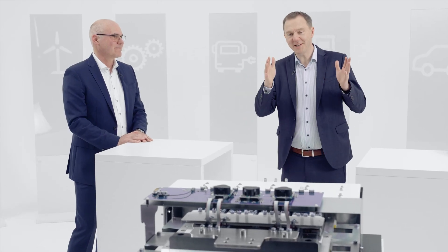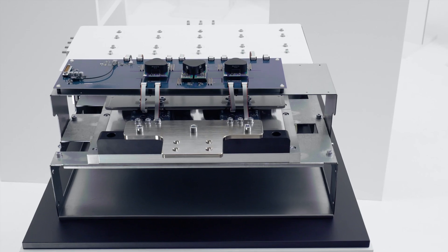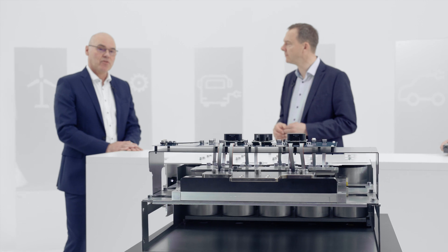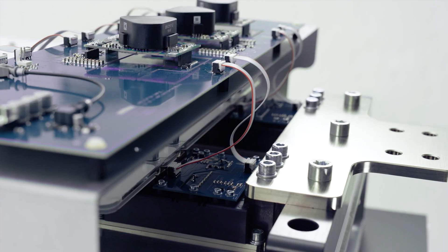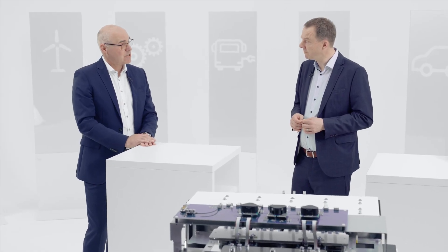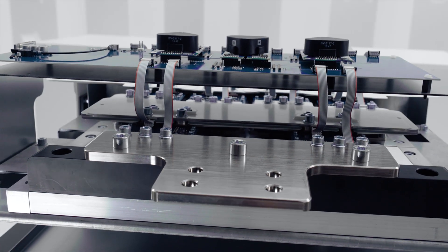I can't tell you how excited I am that you've brought a stack with you today — I'm sure this stack must be full of Semitrans 20s. Tell us about it. This is actually what we call an application sample. We have a fairly large application group supporting our customers, and we do these demo designs to promote our products and show how they are used in the field. This stack is an ANPC topology with altogether six modules on one heatsink, so there are actually two times the ANPC topology in parallel. In this design we're using 1700 volt IGBTs, making it good for up to 2200 volt DC link voltage and 1300 volt AC, which makes more than three megawatt power.